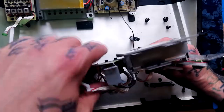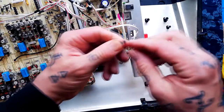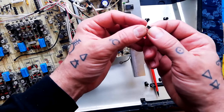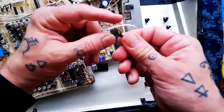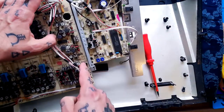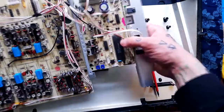Imagining you did want to separate these boards — this is what I'm talking about with the plastic clips. Both parts come in from this side, there are two parts. When you replace it, you push that through the hole — you need to push those four bits together so it goes through the hole, then push the pin into the center, and that causes them to splay so they won't come out again. There's one of those in that hole there, one there, one there, and one there — two to each side, attaching these two boards together. The objective here is really just to show you access for repairs, and we've got that for these boards now.